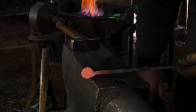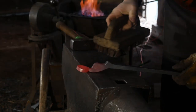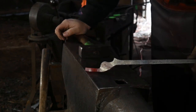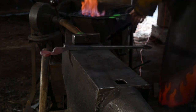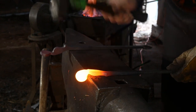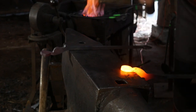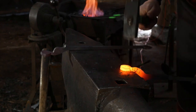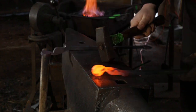It's really good to learn how to use your anvil edges to your advantage when doing tong work and projects like this — it will really help you out. There's one done. We'll set that off to one side to cool slightly while we work the other one. Far side of the anvil edge, then back to the near side, back to the far side, back to the near side, and finish by straightening that out a little bit.